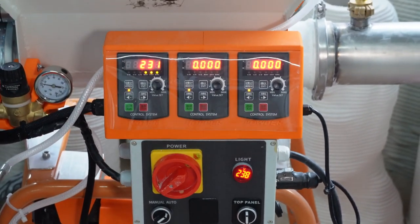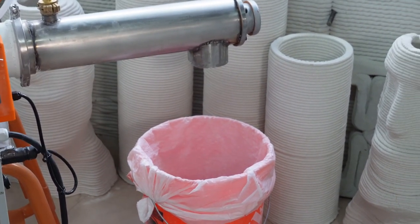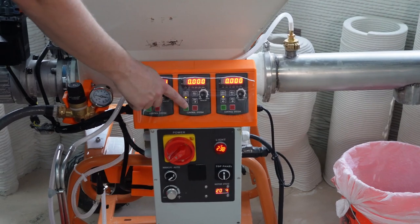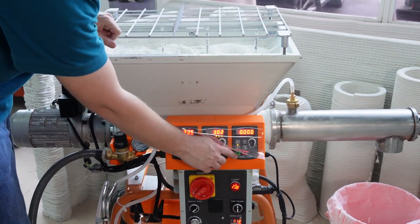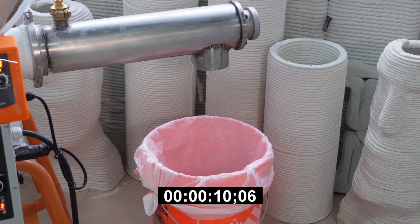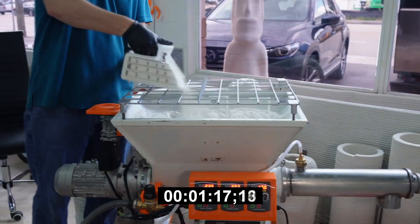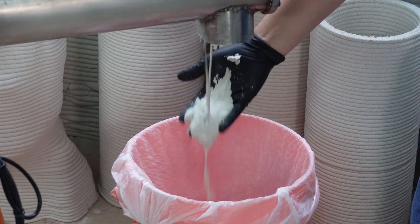Once up to speed, turn on the water and wait until it is coming out. You can then turn on the hopper agitator and the cement powder motor. These numbers represent the motor rpm. You should start with the water set to a higher setting and then bring it back down to your desired amount. For Cica 752 cement being used as a 2k material, we have the water set to 235 and the powder set to 130. It can take up to two minutes for cement of a consistent water mixture ratio to come out. The cement shown here has an ideal amount of water content to be used with an accelerant injection system.